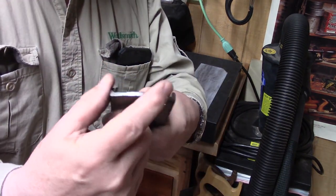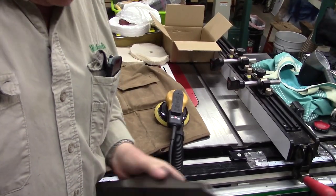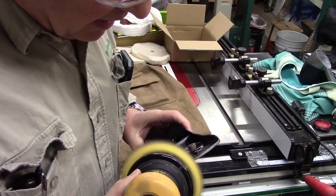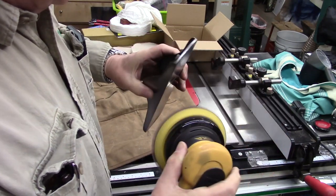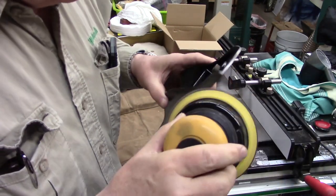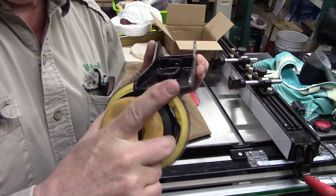and we'll clean up the front, we'll sand it, like 240 grit, and these top edges. But we'll leave the back black, because that's the authentic Stanley plane. We're gonna sand with the Mirka sander these areas. I'm gonna put my dust collection on, it's gonna get noisy. I have hearing protection on and eye protection. 240. We have cleaning up nicely. That last little bit of japanning on the side, clearing that up. We'll finish all the way around, except leaving this again for the authentic look.